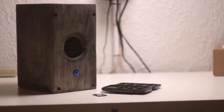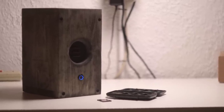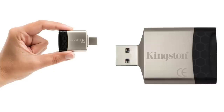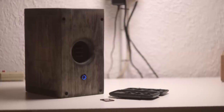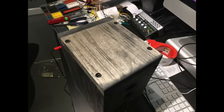Now I want to talk about things I would have done differently if I were to rebuild this today. First, I would have used different card readers and installed them differently — after using this, I left my cards in for a while one day and came back and they were very hot. It turns out on Amazon reviews, this card reader really does overheat. I would recommend spacing them farther apart, or using a different brand that runs cooler. Finally, the thing I'd do for the Mark II is use hardwood. Poplar and pine stain horribly, so I should have left the wood raw and just put a poly over it — and it's a softwood, so it's easier to scratch. Hardwood is something I'd use in the next version.